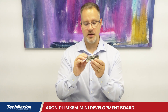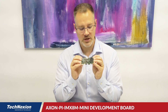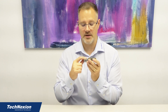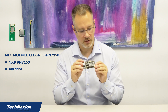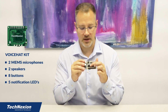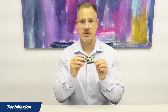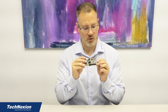For Axon we have what we call Axon Pi. Axon Pi is a Pi form factor baseboard — same form factor as Raspberry Pi. On the back side of the board we have the Axon module, a micro SD card interface, and a click slot which is great for connecting sensors. We have various sensors and wireless modules available for clicks. On the top side of the board we have a 40-pin expansion connector, a voice connection for connecting voice hats, and a micro USB with a USB-to-serial adapter built onto the board itself so you can get console access without any external USB-to-UART adapter.